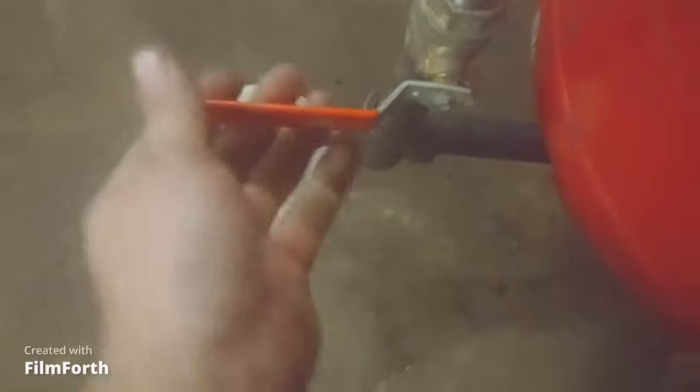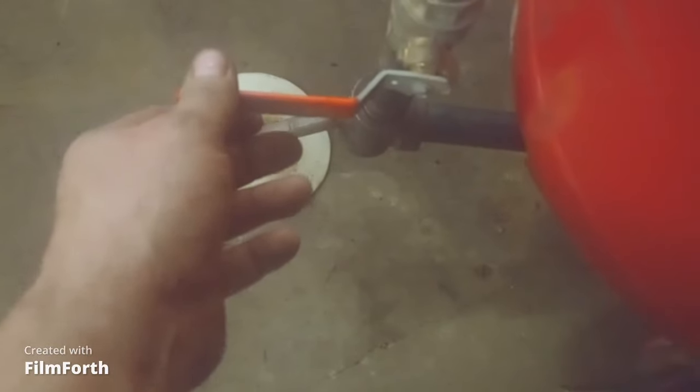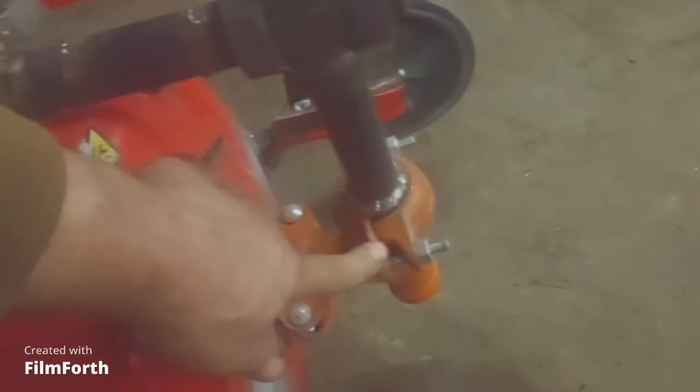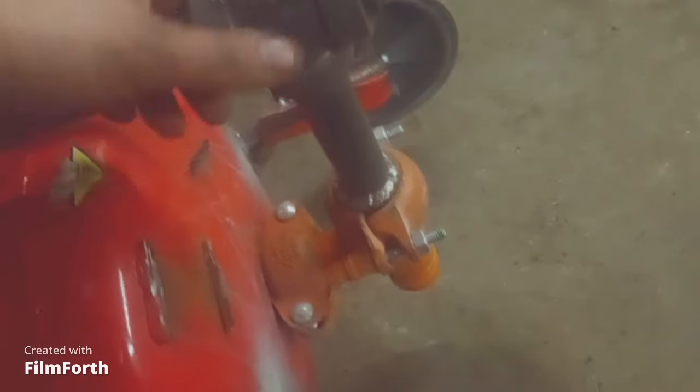This here is to close off so you have a blast of air - block it off so it doesn't go out the hose, instead it pushes more air on the sand and forces it into that T right there. The valve is generally open all the time, allowing air to go down and through that T. Here's where your sandblasting hose hooks on. What's cool about these victaulic connections is that you can take them apart, literally unwind everything off here, clean them, put them back together, and bolt them back together again.